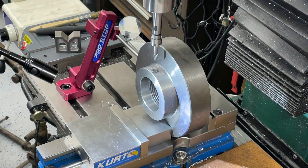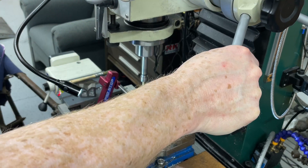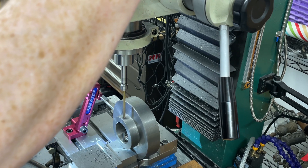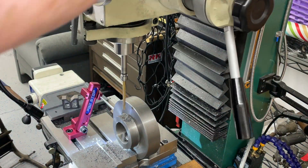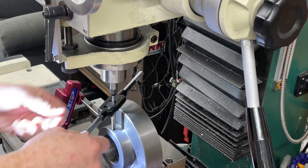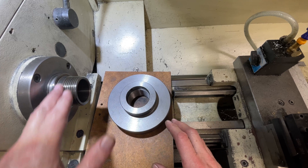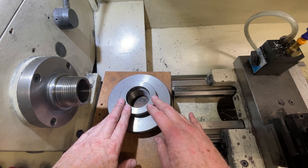Center drilling the top hole and now drilling through — my clumsy arm gets in the way. Now turned around, and you can see the gauge pin in the previously drilled hole helping me align the two vertically. And finally tapping the holes. It is vitally important to get these threads clean so that there is no chance of chips pushing the plate out of position when we machine it.